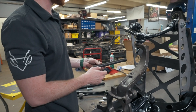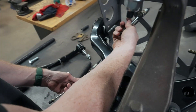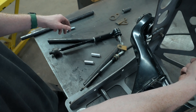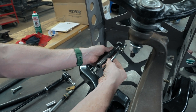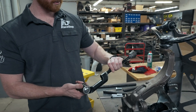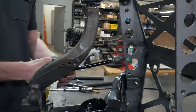We're going to have a steering rack in a tube that's going to go here like so. We're going to have this bracket welded there and that's going to have a nice machine knob on it, probably from Dylan, and when I pull the knob it's going to slide this in and out like a cable and actuate the steering rack which is going to turn our knuckle left to right. It's going to turn this tie rod in and out — I need to put thread in the end of one of these — and we're going to have a steering rack.